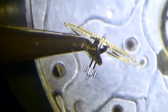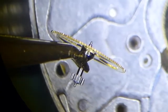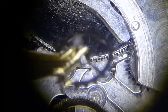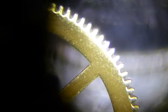This here is our third wheel — and that is actually looking nice and clean, no problems with that whatsoever. Now we have a look at our escape wheel — again nice and clean, no visible problems. Now we're looking at the fourth wheel, or center second wheel — and here we can see a problem. You can see between those teeth there's dirt. It looks to me like skin flakes — somebody touched this wheel with a finger and got some skin flakes on it. That is enough to make this movement not run properly. It's all it takes, but easy to diagnose — you can see it under the microscope.